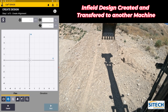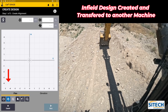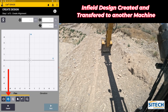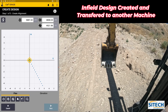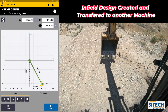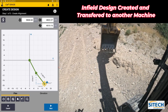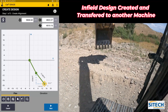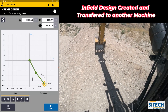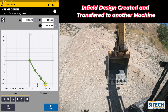I'm going to use the focus point of the machine — right off the bat, the right side of my bucket. I'm going to reach out and climb up there just a little bit and make a point right down the edge of this pond to my right side here. I'll hit the blue button and record a couple more points to get the definition as it falls here. I'll keep recording with the point on my right side.